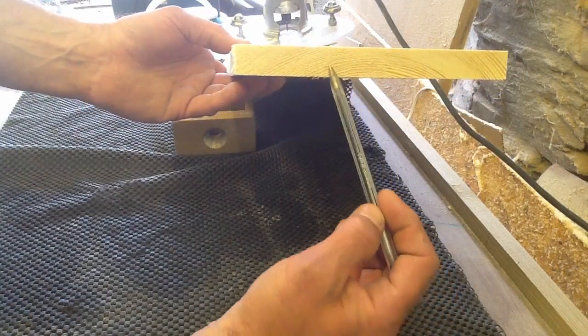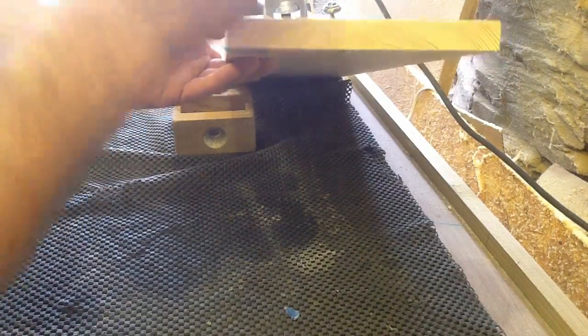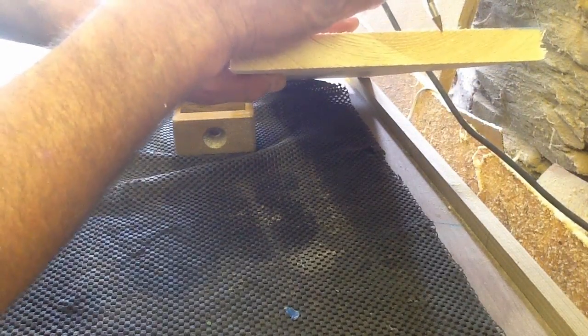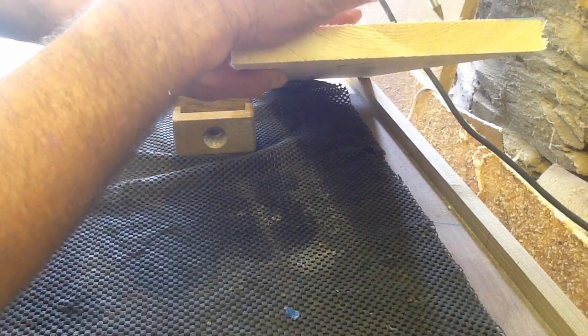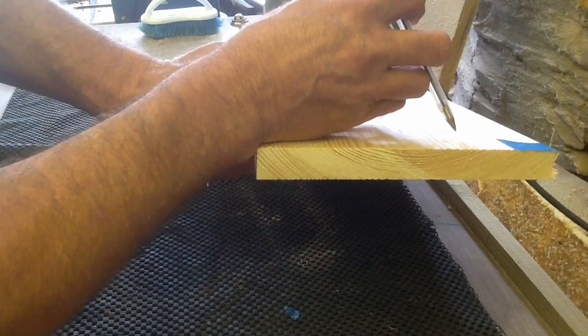You can see how the rings are going. When I'm routing, I want to go through as few of those rings as possible to get a consistent cut. If I have my sign this way and I'm cutting, especially in certain areas, I'm going through multiple different grain layers at one time. Each one of those could potentially be a different strength — traveling through hard grain and then hitting an easy one, and the blade will jump.